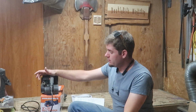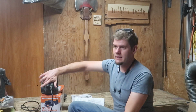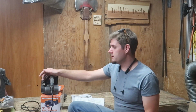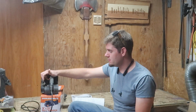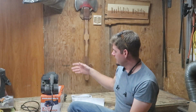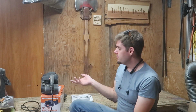That is an absolute why moment. I would honestly say it's a little redneck, but I would take the screw out and go through by hand with a coping saw or some kind of little blade off of a Sawzall and cut that out so that you actually have proper dust collection. Otherwise I'm getting a whole bunch of dust buildup in there because of a large piece of plastic that houses the screw to mold two pieces of plastic together. It's a design flaw, and I mean, I'm complaining over a $30-$35 tool.